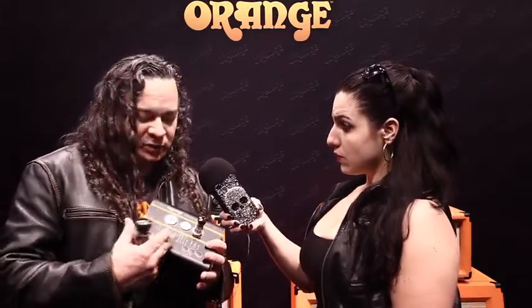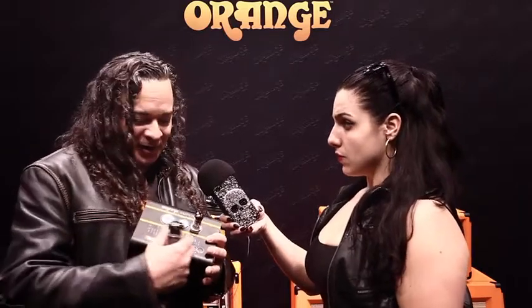What's great now is, a couple of years later, there are many great multi-gain stage amplifiers in the market. So what this essentially enables you to do is test a tube, but it also enables you to rate very effectively how much gain that tube has, on a scale from 1 to 15. So it basically means you can craft exactly how much gain you're getting per preamp. If, for example, on Monday night you're doing a country gig, you want a tube that's got less gain. On a Tuesday night, as your metal gig, you're probably wanting something with more gain.